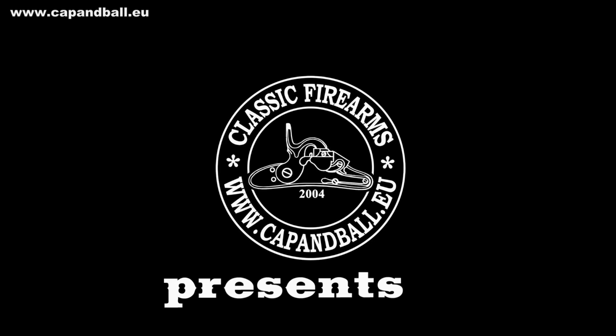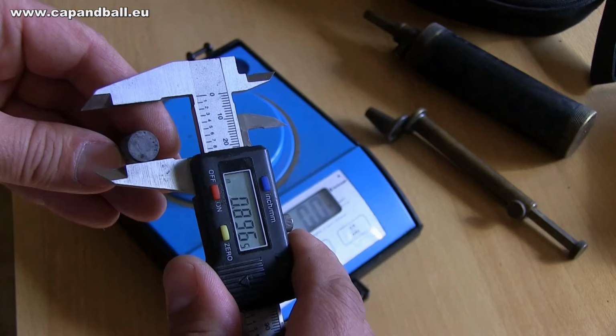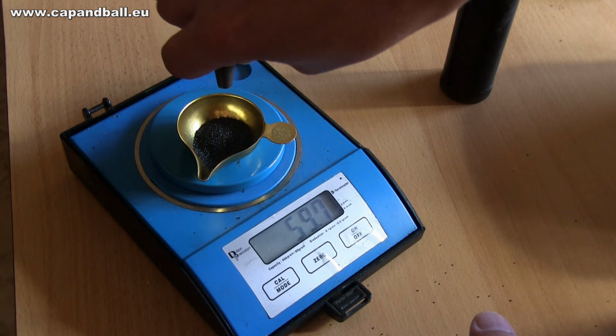The hexagonal bullet molds are expensive and hard to find, so I went for the same cylindrical bullet I shoot from my .451 Parker Hale Volunteer rifle. I sized my pure lead bullets exactly to the land-to-land diameter of my bore. These Spitzer bullets weighed just a little bit more than 460 grains. My best charge was 60 grains of 3F Swiss powder.